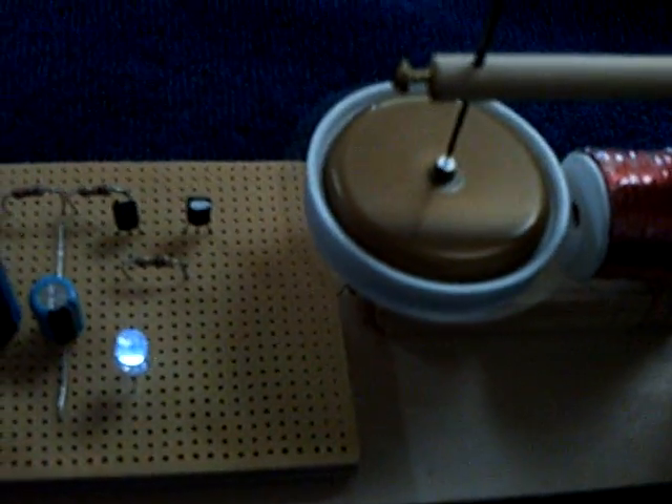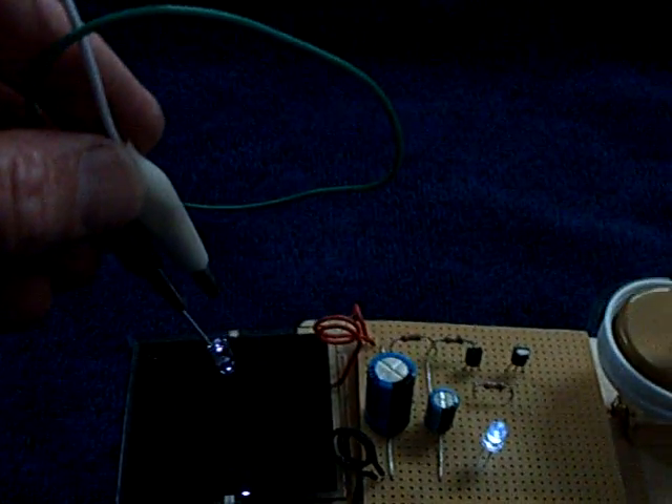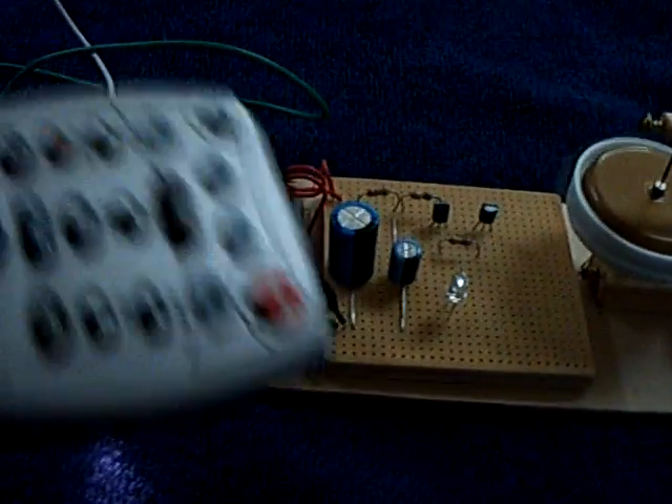I did want to share that these type of solar cells — I can't remember the name of them — work on infrared, which means you could run this in the dark without any light source at all. It looks on the camera like a dim LED, but take my word for it, I cannot see this — this is infrared. You can pick up these infrared LEDs at Radio Shack; it's basically what's in a TV remote. I tried a remote with this little solar cell on a voltmeter — sure enough, if you hit one of the buttons you get a voltage reading out of that solar cell. Very interesting little device.